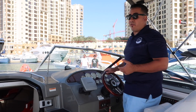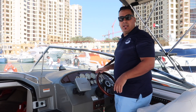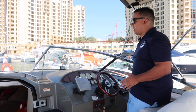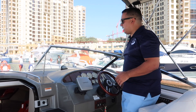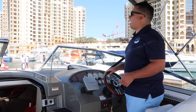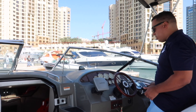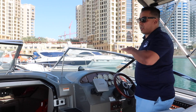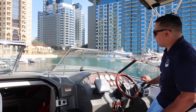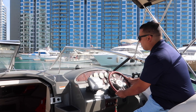It's important to take it really nice and slow when pulling away from the marina — boats do get scratched from members parking and disembarking. I only have the left engine engaged because the pontoon is on my left and I want to be pulled away from it. Once clear of the pontoon, I give it a full turn and engage the right engine, which gives more speed and a tighter circle. Once the boat is almost parallel, I put it back in neutral, then engage both left and right engines and start moving forward.